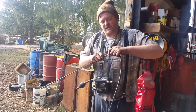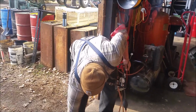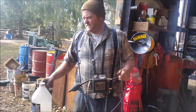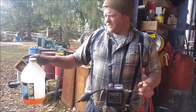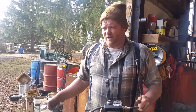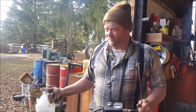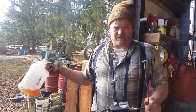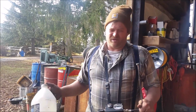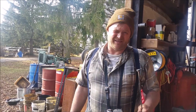The correct way is to steam them, and some guys do it with a steam power washer. Just let it run in there. Basically what you're doing is sweating out the gasoline fumes and vapors, which actually get right into the pores of the steel of a tank. So having it empty and dry for a while means nothing. It can take years. For big tankers like we run, you have to actually steam them out and check them. That's the proper way to do it. But for little tanks like this, people will fill them full of exhaust. That's fine.